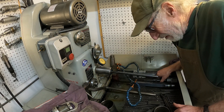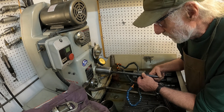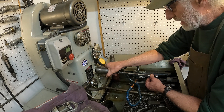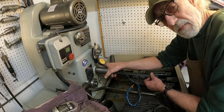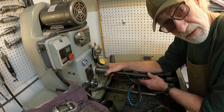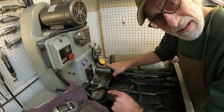The problem at hand — why I'm introducing you to the machine — is because I have to use it, and that's a good way for me to show things as I need to use them. This mandrel here is a little different: these are less expensive and generally in the smaller sizes. They don't have replaceable shoes — it's just a solid one. They make these mandrels out of different materials: hard steel, soft steel, and bronze, depending on what you're honing. The stones range from diamond to aluminum oxide to CBN.